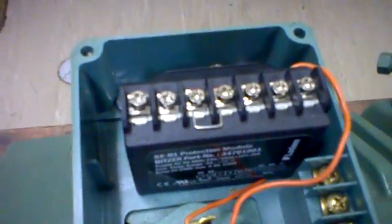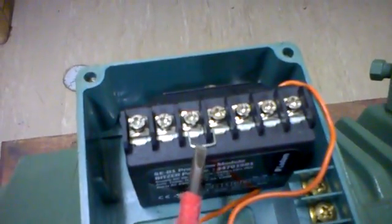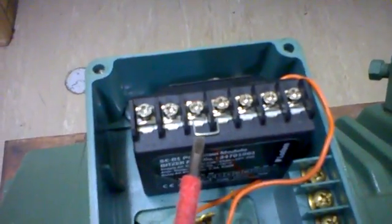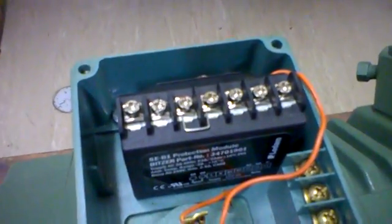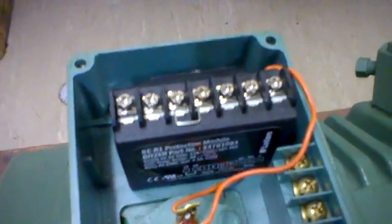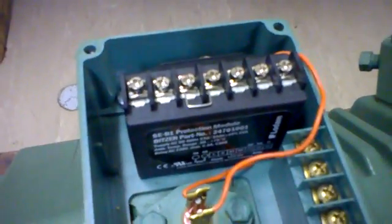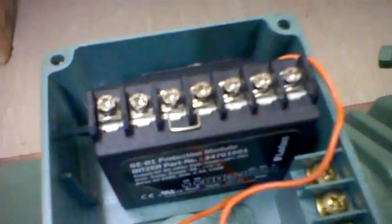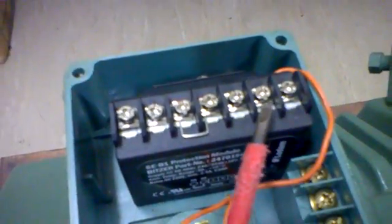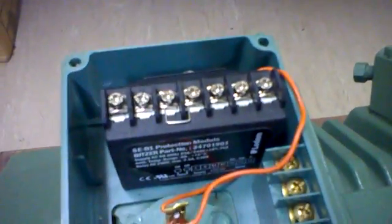It comprises only a few inputs. Basically we have a line neutral input coming in from the top. We have a bus link here, which is designed to be factory linked out, but if preferred it can be removed and put into a lockout chain for an external lockout input — if you wish to shut this compressor down for some other particular reason, like interfacing it with an oil-failure switch, or perhaps a building lockout input to drop all the equipment out. But typically it's bridged out. Then we have the common input, compressor run output for your compressor running contactor, and a fault output.